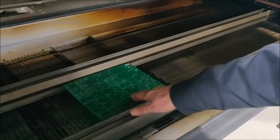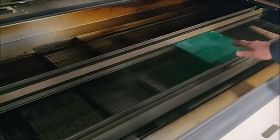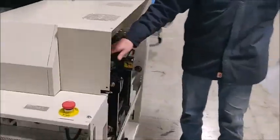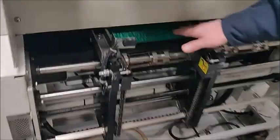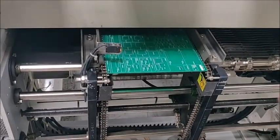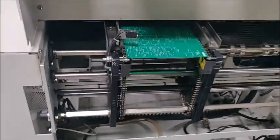You can see the little extra gap here. When we get down into the heated zones, we intentionally open the width up a little bit — maybe about a millimeter — because the board will grow when it gets hot. You don't want it tight in this end of the oven or it will put too much pressure on the chains and wear out the rails. That extra play is intentional. It will be maintained all through the reflow zone. We narrow it up a hair on the end to help guide it onto the next conveyor.